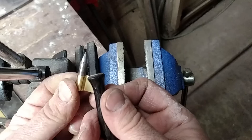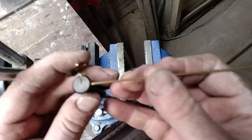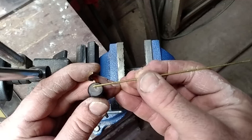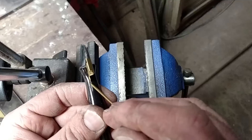That will leave a little bit of room so if someone wants to adjust their flange or what have you. And then the other thing I do is I take a drill and I drill in the backside, right in that area. I drill it so that the pin — this is over-exaggerated, but I use a 20-thousandths pin — it goes through the metal and into the wood. Put the pin in there, put a little bit of epoxy on the top, and your flange is set in place. I take the epoxy and fill the top of this gap and fill this gap up here.